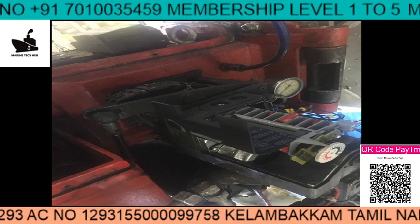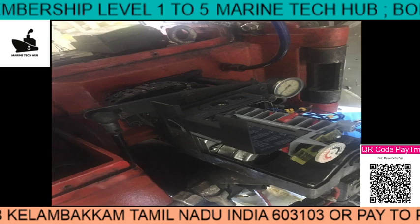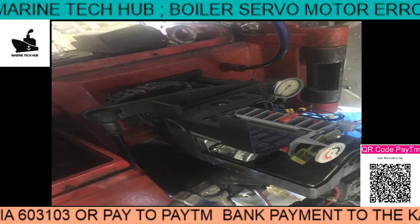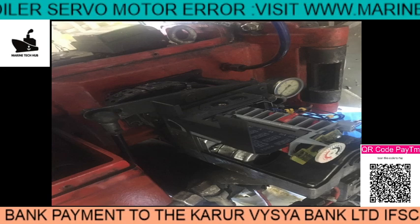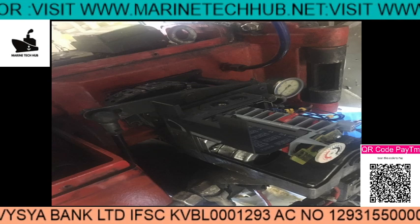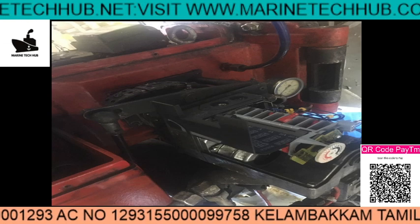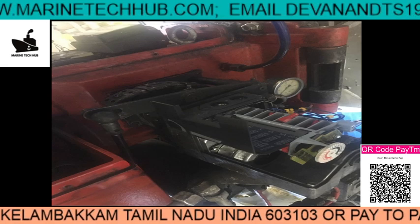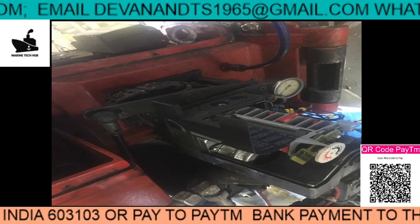The timer for low-low combustion air pressure — a normally open contact — the timer for low combustion air pressure is not closing, even though the timer has 220 volt supply. That's why we are not sure, and we cannot find the proper drawing. We don't know what to check step by step. The electrician already tried to check the supply and everything going to the motor but without success. We put a jumper across this contact to close the circuit, but the problem still exists.